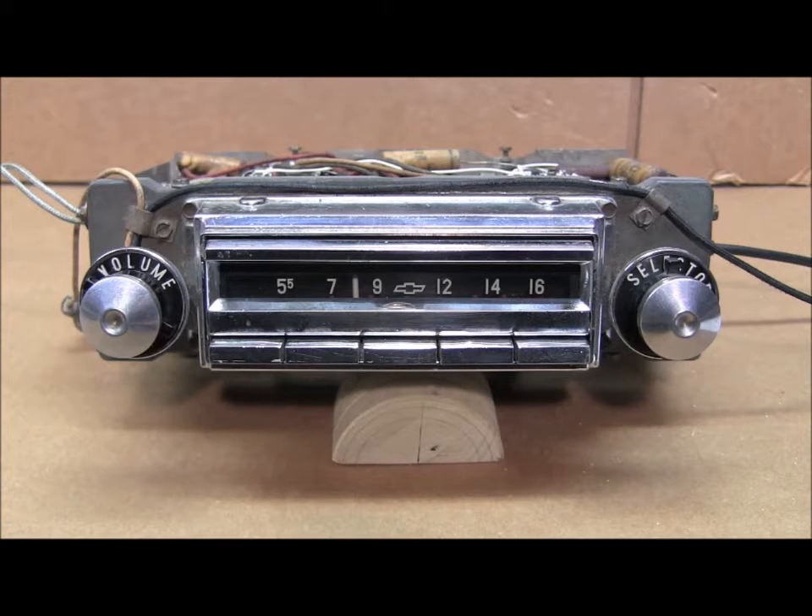In this calibration procedure, there is a small LED on the FMC1 board that will walk you through each of the steps. During each step, the FMC1 will wait for you until you start moving the tuning dial. It waits while the tuning dial is being moved, and when it finally stops, it waits several seconds and then stores the setting and moves to the next step.